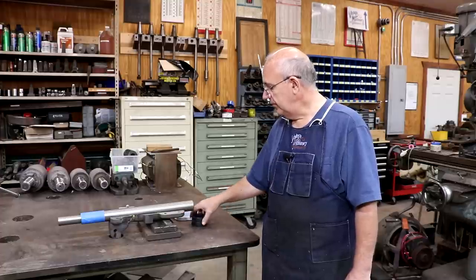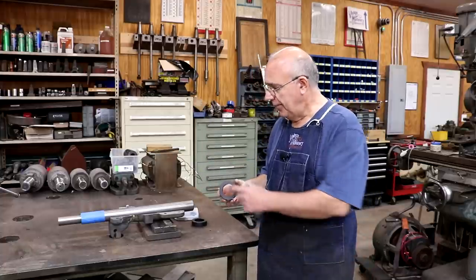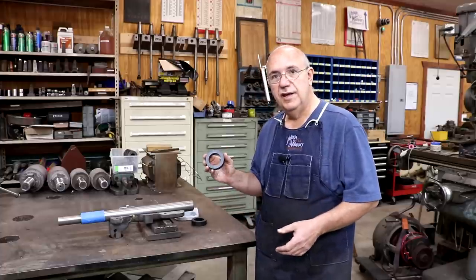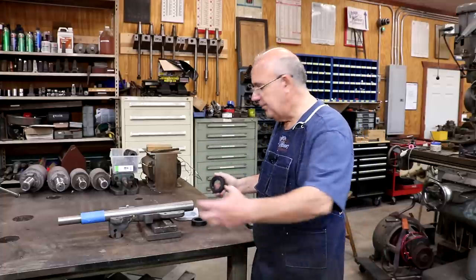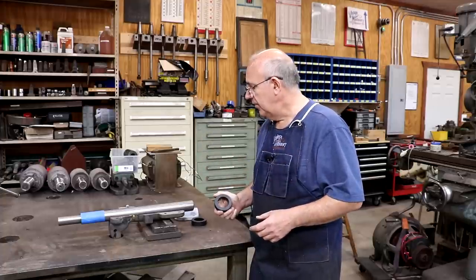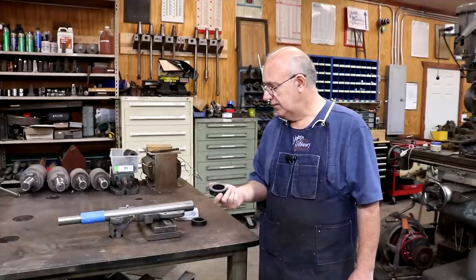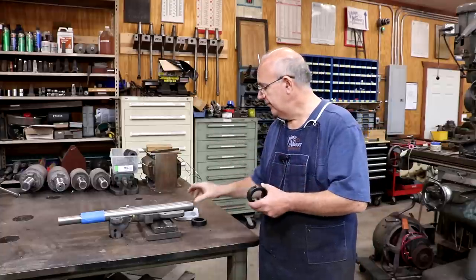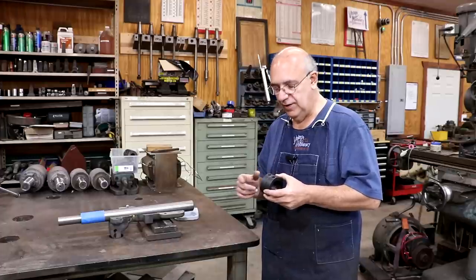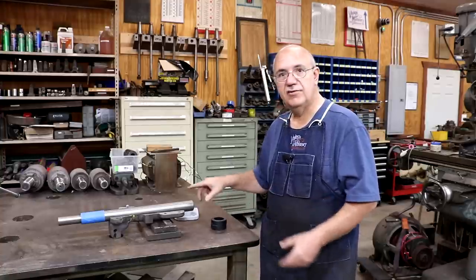How are we going to do this? We're going to use some shaft collars here. I'm going to have to bore these out to fit this - this is just something I had laying around. I'm going to machine a little step in this. It's going to fit up into the edge of this, and that's going to position the shaft exactly where we want, and these will also serve as a dam when we're pouring the molten Babbitt in here to keep it from running out the ends. So let's get in here. The first step is we need to go over to the lathe and bore these out to fit this shaft.